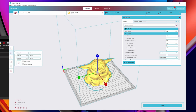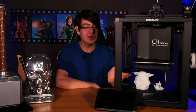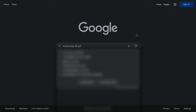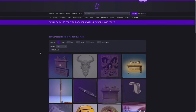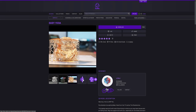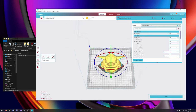The basic idea with a 3D printer is that you can take any 3D model — which you can find online or make yourself using 3D design software — and convert it into a language the printer can read using a piece of software called a slicer. The Ender 5 ships with its own special version of the popular Cura slicer called Creality Slicer, pre-loaded with configurations made specially for the Ender 5 S1. If you want to find 3D models, you can pretty much find anything by searching '3D printed movie prop' on Google and you'll find a variety of free and paid options. I decided this Baby Yoda model by LEWJ would be a good place to start, so I downloaded it, extracted the file, loaded it into Creality Slicer, scaled it to my liking, and sliced it using the default quality settings.